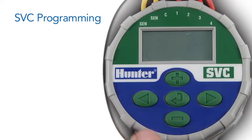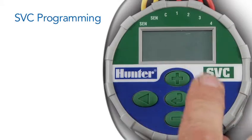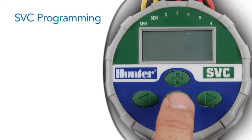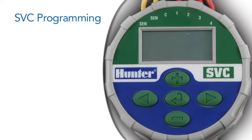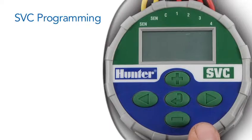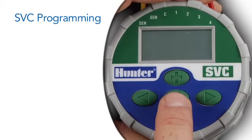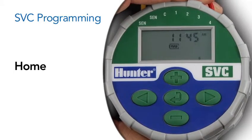A right arrow, left arrow, that'll move the cursor around the screen. Minus and plus will change whatever is flashing, and the center button will change the page or the chapter over to the next function. Do note that these controllers are always used with the DC latching solenoids on the valves. So we'll start by hitting the center button, and that brings up the display.